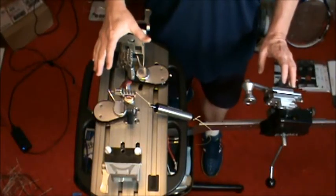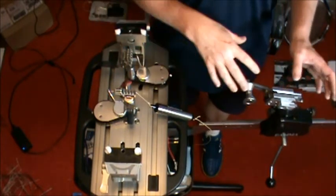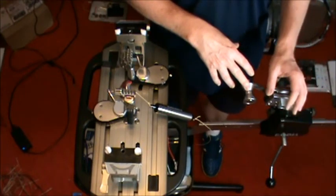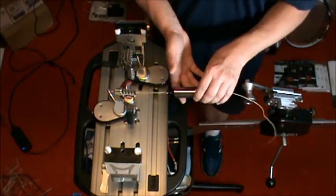The previous videos showed how to check. They've done what I've shown you thus far, but they didn't actually make any adjustments on their tension head because I guess it was close, it was already calibrated. So I'm going to intentionally put mine out of calibration, and we'll rectify that and put it all back to the correct adjustments. So let me zoom back out. Now that we're zoomed back out, I'm going to show you how to set things up on the back of the tensioner. I'm going to intentionally uncalibrate, if you will, the tension head. I'm going to have it intentionally be 10, 20 pounds off from what the actual reading is here.